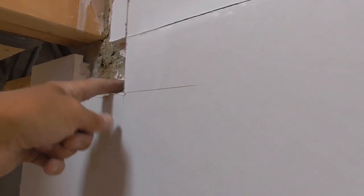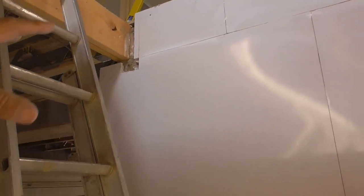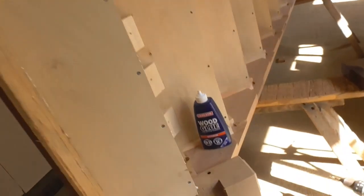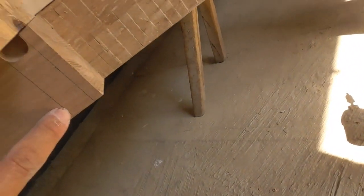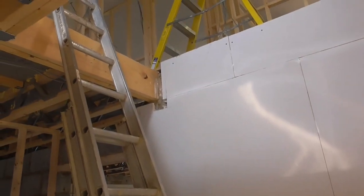I'm suffering from FDB today and one of the symptoms is a lack of concentration. Unfortunately I stopped myself before I got all the way through. We've got about 25mm from the face of this block work to the face of this plasterboard. Although I'm going to leave the string a couple of mil off the wall for skimming, we actually need the distance close to 30mm. So rather than chip away at that brick work and block work - because that's a bearing point - I'm going to cut maybe 2 or 3mm off the outside face, which will allow that to slide straight back against the wall.